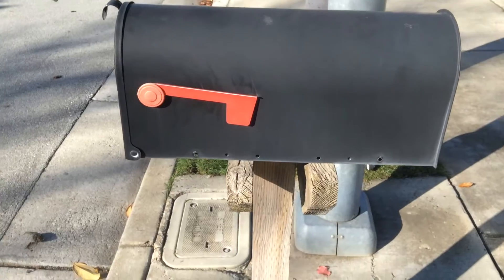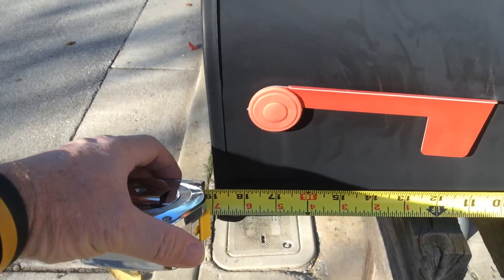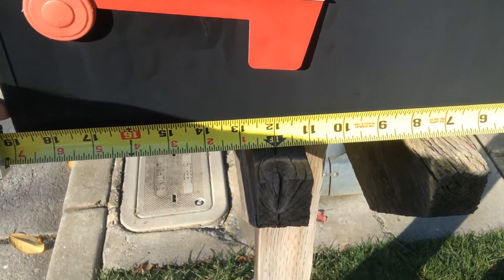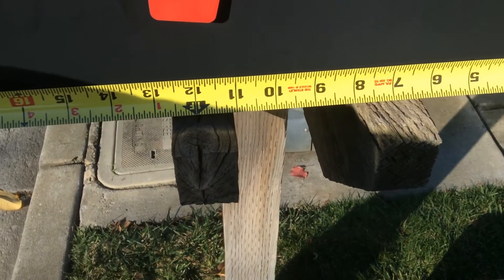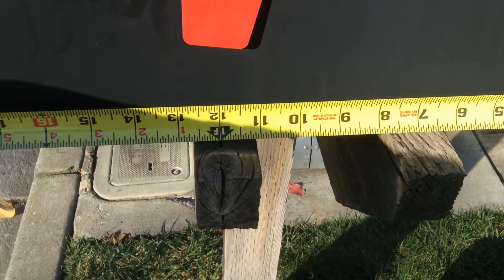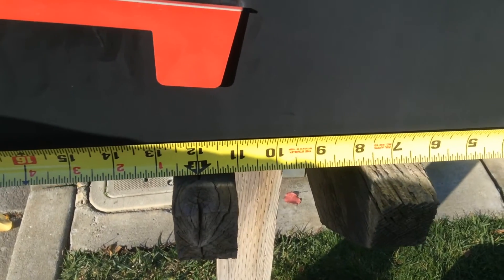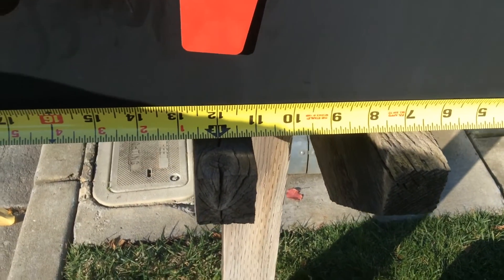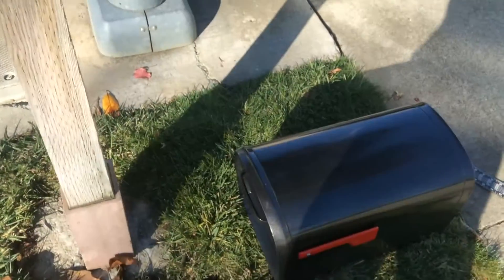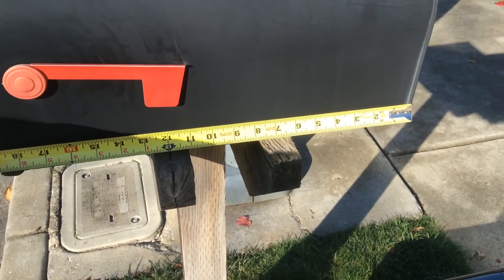The original mailbox is 19 inches long, and I noticed they kind of split the length across the 2x6 lateral — basically it's right at the 9.5 inch point, half of the 19. Since the new installation is about the same depth or length, I'm going to make it flush and go with the 9.5 inches from the bottom. The new one kind of flares out at the top, so I'm going to try to use the bottom length — I'll show you in the next video.